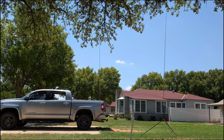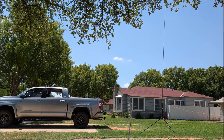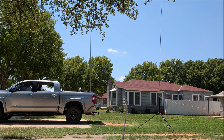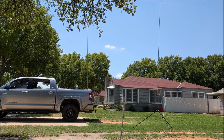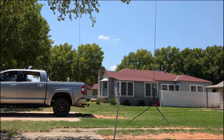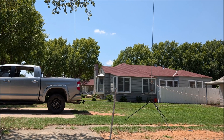So far I've gotten very good signal reports using this setup, and I think I've been able to make a lot of contacts I probably would otherwise not be able to make. This setup appears to be a very simple way to boost your signal and it's a very easy antenna to set up in the field too — you're basically just using two POTA Performers. If you have two whips, you might give this a shot. In the field, the easiest approach is to use my stake pocket mount on my truck as the radiating element, and then a tripod with a POTA Performer or my PVC mount approximately 10 and a half feet in the direction I want to go, set up 5% shorter than the radiating element.